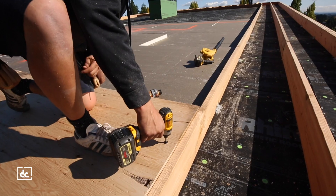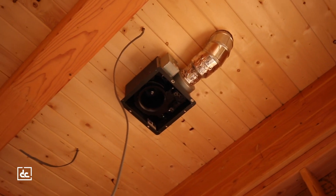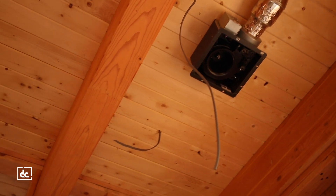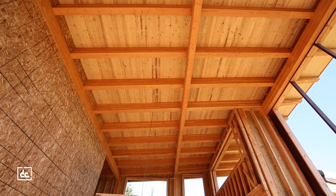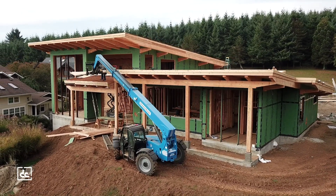We're going to have an R51 insulation on this roof. Below all this insulation is a finished roof deck that you'll see from the underside, and by doing the Hunter panels we can keep that roof cavity a lot more streamlined and lower profile.